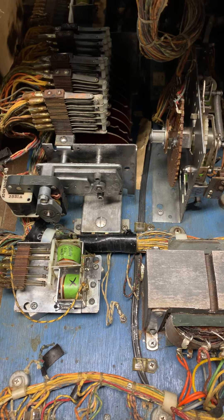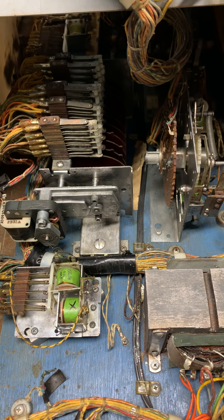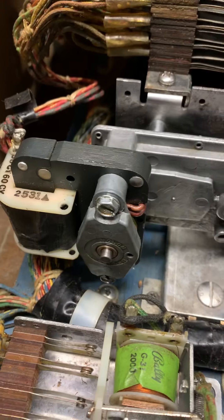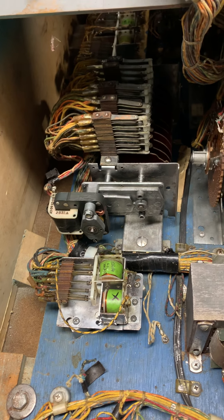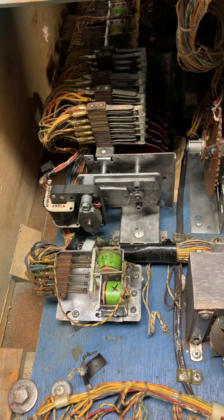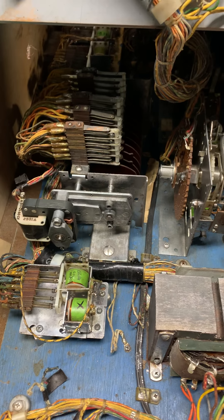It works. All I did was add a spring — before that it was not working — so the spring was just enough pressure to push it in there and make it spin. I lubed up the bushing really well, and I also sanded it with some fine, fine grit — I think it was 1000 grit sandpaper or better — just to get all the gummed up dirt out of it or whatever was causing it to malfunction in the first place.